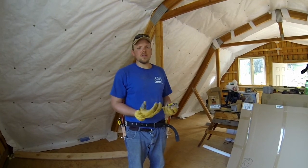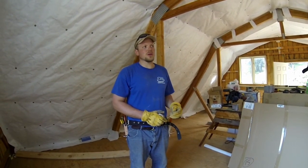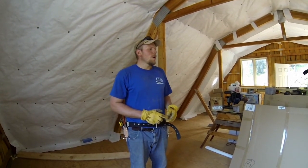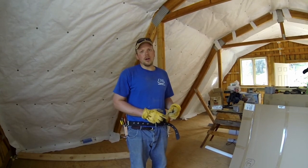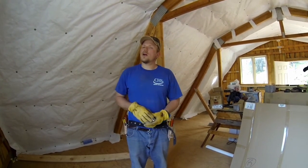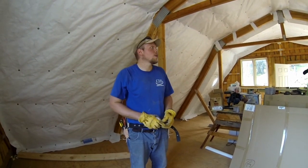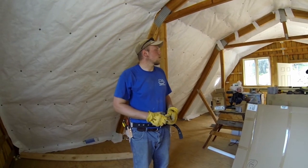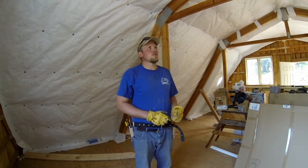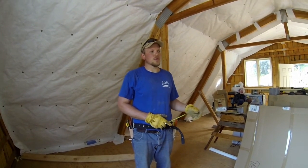And we don't want the spray foam to rip off when the roof is replaced. So this will give us a barrier, and it'll give us an additional moisture and vapor barrier between the residence area and the outside. So just adding to it. You could do maybe plastic sheeting or whatever. We just did the Tyvek because it's light and strong.